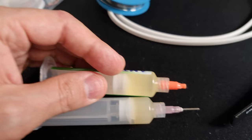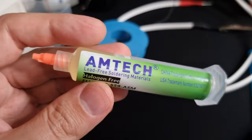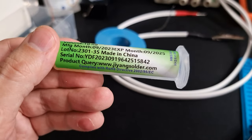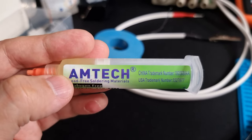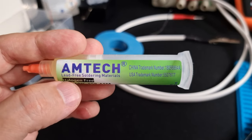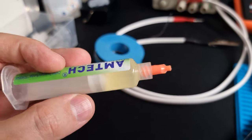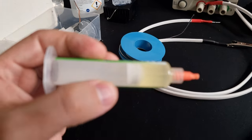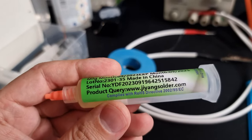The knockoff stuff is hideous. It smells like tree resin — has this funky smell to it — and if you don't clean it up soon enough, it dries up and becomes solid like tree sap. Then you have to heat it up to be able to remove it. This stuff is not Amtech. I do use it for core reballing when I need to use a lot of flux and I'd rather not use my good stuff. But in other words, be careful on AliExpress about where you buy this stuff.